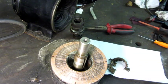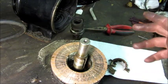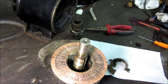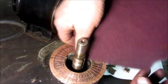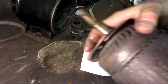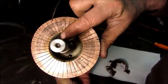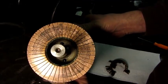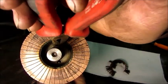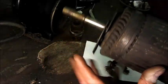So I'm going to go do some parts cleanup. You could just take something and rub down in there and clean it up, but I'm going to use the lathe to do it more quickly. Now there are two push rods inside here — those two pins. And those work based on the flyweights at the front. I know on other motors I've worked on those would fall out, but I think on this one they're retained.